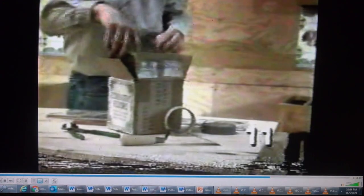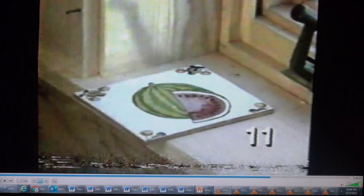On the walls, we set ceramic tiles, and this job was a little more straightforward so we handled it ourselves. The tiles are hand-painted in Spain and feature the design of fruits and vegetables that you might find in a typical country garden. The full tiles are framed by smaller border tiles. Organic mastic is used to secure them to the plywood under the cabinets, and we lay them out with enough room below for the countertops and the backsplash.